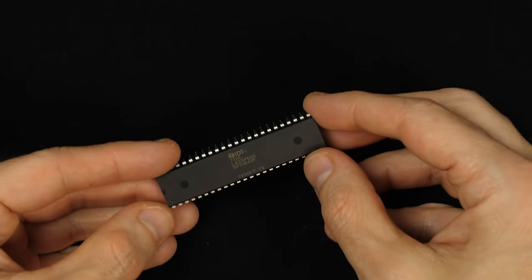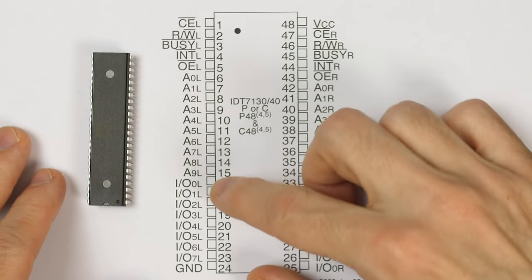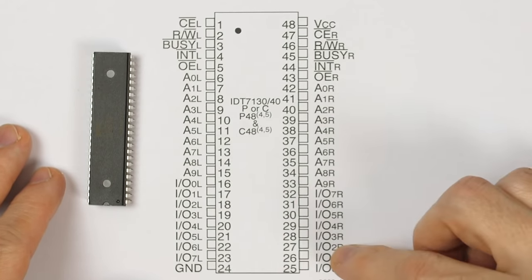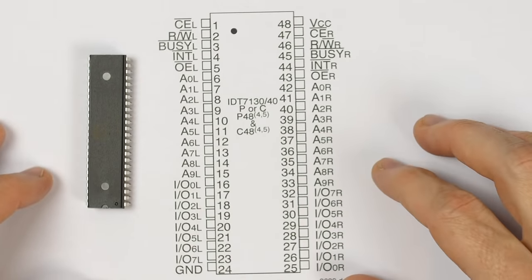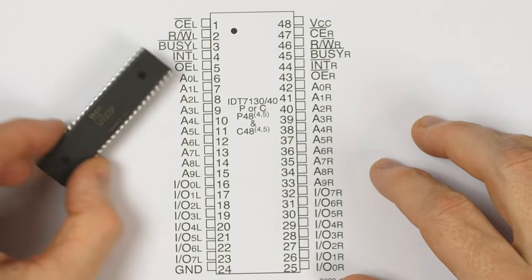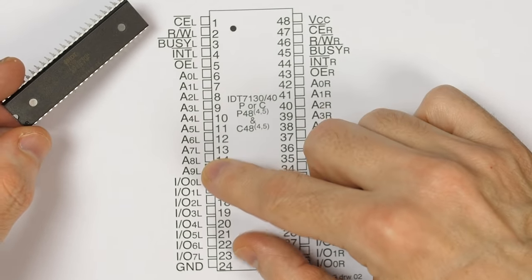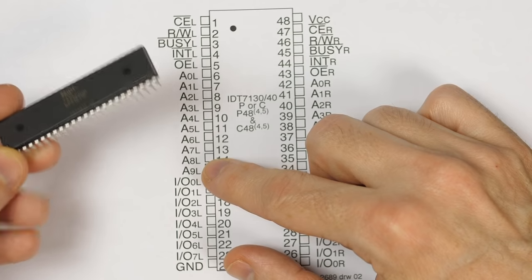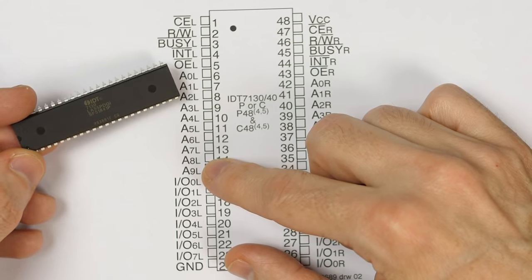A big innovation in the mid-1980s, used throughout the 90s, was dual-ported RAM. This monstrous chip is RAM that has basically two sets of address lines and two sets of I/O lines for data, so two things can access it at the same time. This is how a lot of video cards used to work back then. But nowadays these are becoming more and more rare — this chip I was able to find only has 10 address lines, so it's only a 1K memory chip, not even big enough for our frame buffer.